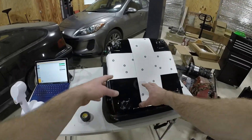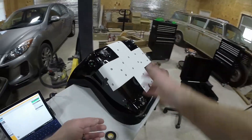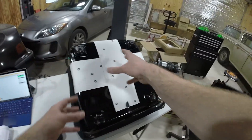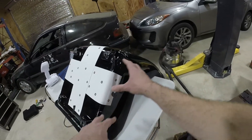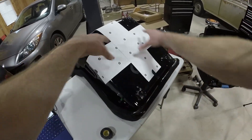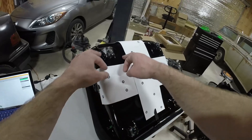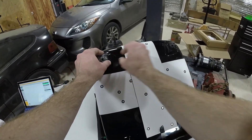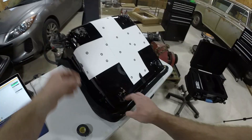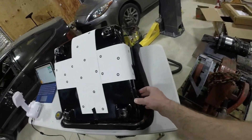From the last video, I took these positioning targets and put them down on this poster board to basically make them more reusable. Here I'm showing how I'm doing that — laid one strip horizontally, one strip vertically, taped down the ends, and then I have a couple of positioning targets exterior to the poster board targets so I can capture my plane, really define that geometry, and then my bolt locations as well. This will also allow me to capture all these features sticking off the chair. The first scan should capture all my targets and poster board just fine. It's the shiny areas that are exposed — those are going to be harder to pick up, and these planes are going to be basically invisible unless I get a way to put texture on there.